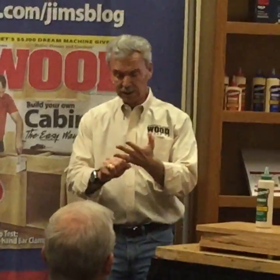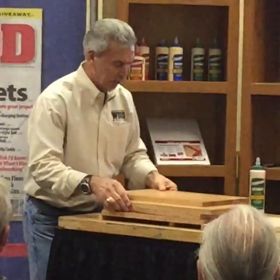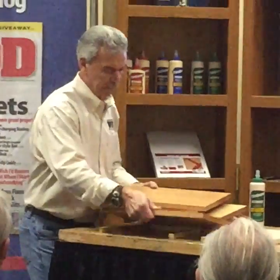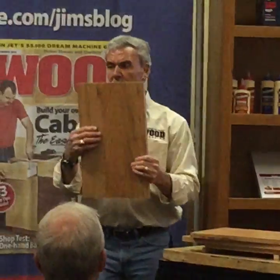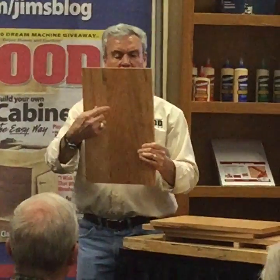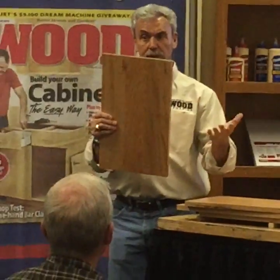I don't have to think about it, don't have to do anything, and I just set it aside to cure or dry for whatever length of time it's going to be. A lot of people feel that that's going to ruin the glue line. I'm sorry, the glue joint, or it's going to leave glue in the joints or in the pores. This darker board here is probably the darkest one that I've got. So this is oak, and again, oak has a lot of deep, real big pores, where glue should sit. And I've got some dark lines in here, so hopefully it'll tell. And the finish that's on here is lacquer, so that would show up any glue squeeze out.